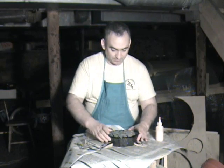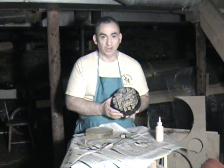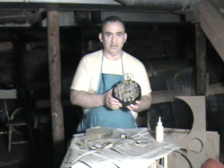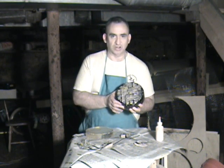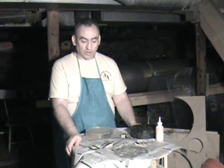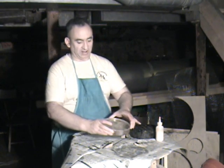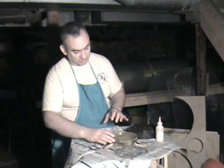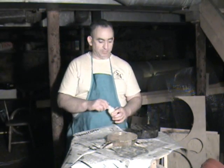Now I've got a pitch lap with channels in it — they've been closed a little bit — and my next step is to cool it off so that the pitch lap hardens up, because right now it's too soft to polish. I'm going to do that under cold water and then come back and polish. When last I was polishing, I was polishing with my optical flat on top. Now I'm going to put my optical flat on the table, secure it with my clamps, and polish with the pitch lap on top.